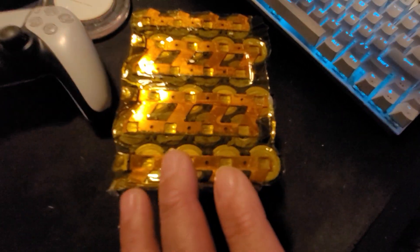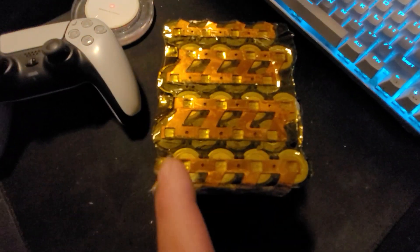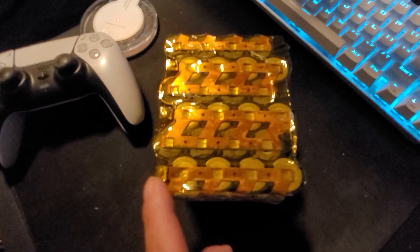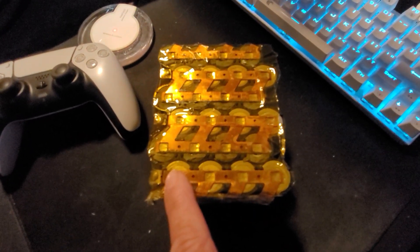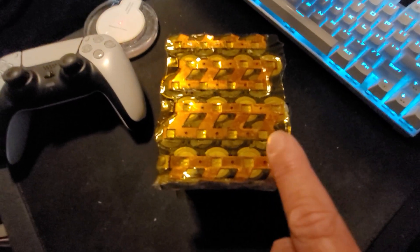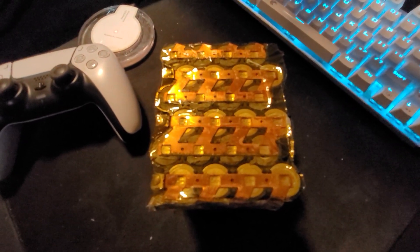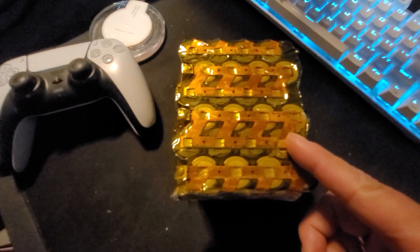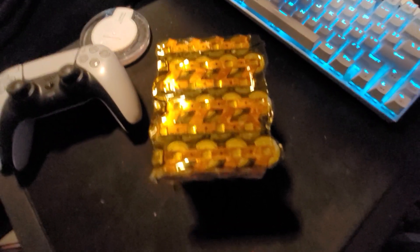All the amps are being divided up and flowing evenly. When you build that snaking pattern, you're going to have a high resistance pack because you're trying to force a lot of current through one path. Even if you make that one path thick — beefing it up — that is not going to help. It may not burn up, but under load it's going to be getting hot where it goes from stage to stage. The internal resistance of that battery pack is going to be off the chart.